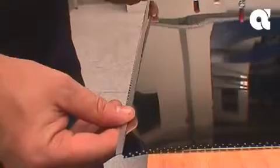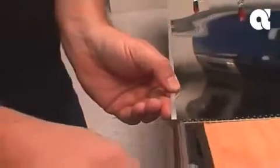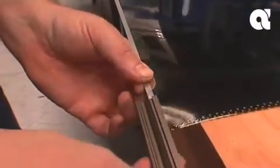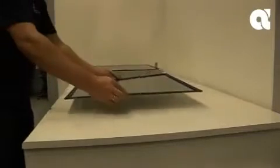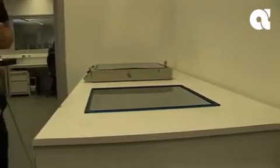The first attempt to address these concerns was the Vector Guard, also known as the Alpha VG foil, in which the foil itself is mechanically attached to a subframe that engages with the tensioning frame. This move eliminated the potential health and safety concerns and improved the stiffness of the foil. But the blank still required pre-etched or stamped engagement holes around the edge of the foil. In such a mechanical arrangement, the tension cannot be as uniform as in the original mesh-mounted design, where the stencil was bonded continuously to the mesh, and the mesh bonded in a similar fashion to the substantial frame.